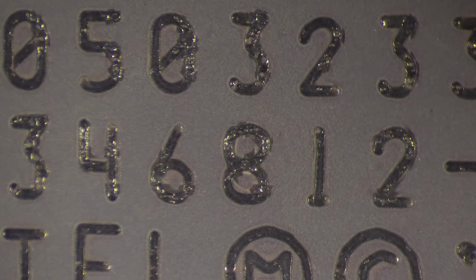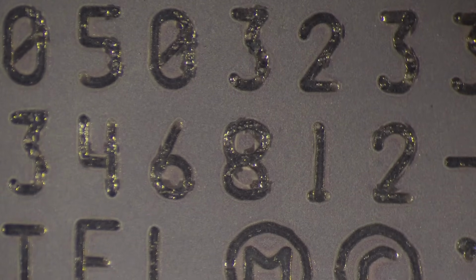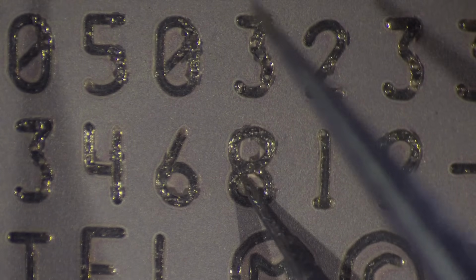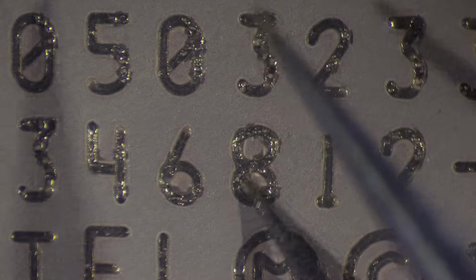Yeah, this 8 looks a little bit questionable. I think the laser just took off some of the coating here. I can scratch off stuff here. Let's have a look at the second one. That's definitely a fake because it also rubs off the color, and it is a 233 megahertz version, which Intel never released on ceramic. I don't even think there is any 233 megahertz ceramic CPU from Intel.